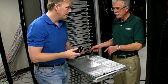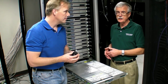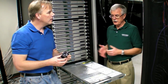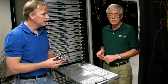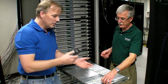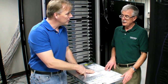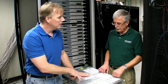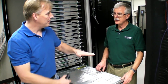It's actually higher than that because of power supply and board inefficiencies. Measured at the wall socket, it's about 150 watts. So out of roughly a 400-watt server, 150 watts is driving those fans when you're using 35°C inlet air — with all the losses included. We were talking about 15% savings back in February. These units are running at about 60°C core temperature.